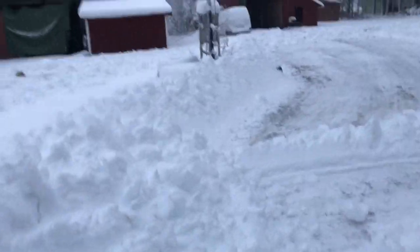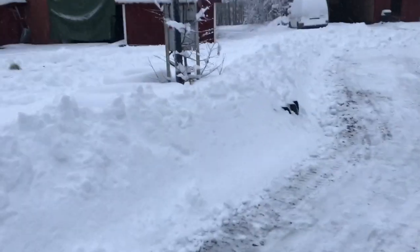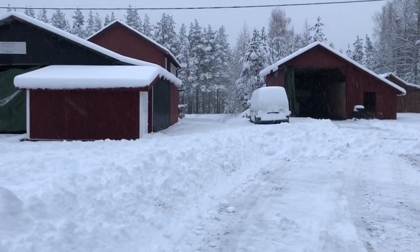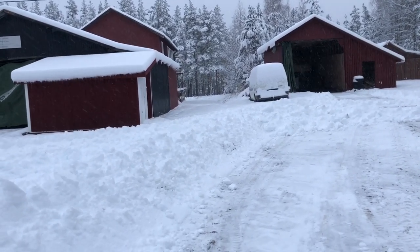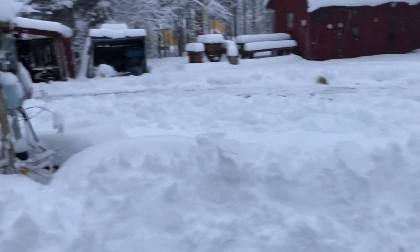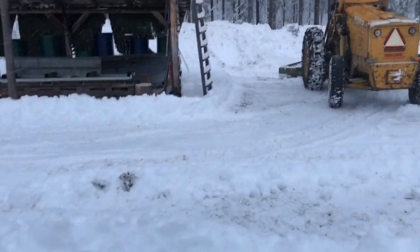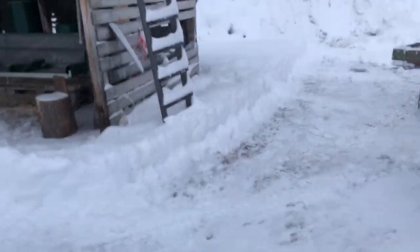The importance of putting the drainage ditches in, like you saw us do it on the last video, was all of this. Of course, this is just our first snowfall of 6 months, but it will all drain down there, all of it. So we have to keep that clear. And there's a big drainage ditch at the bottom there, which I've got open, plus a culvert. And all of this stuff will melt and run down there. I don't think we need to leave this running. I don't leave it running unless it's below minus 10. And we're not below minus 10.